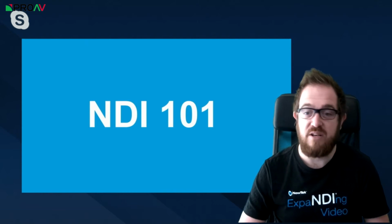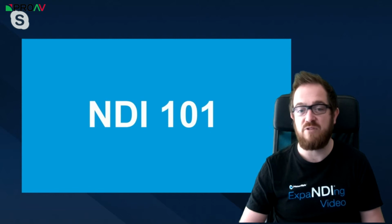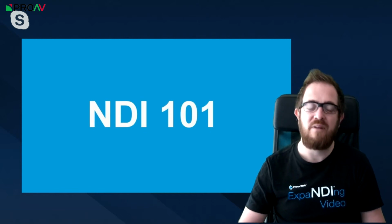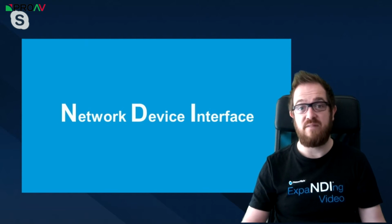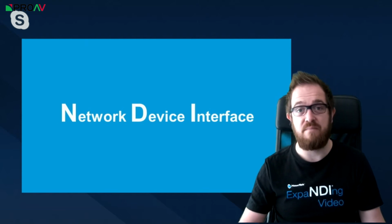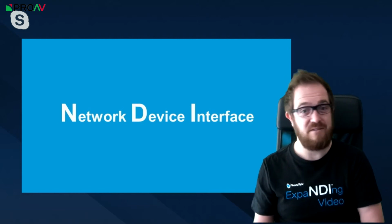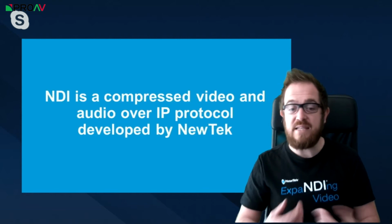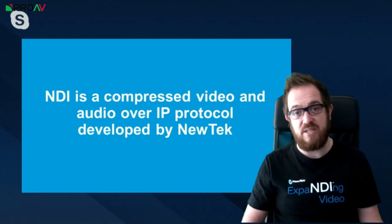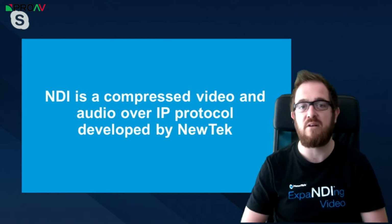If we just have a quick look at some of the basic concepts within NDI itself and what we set out to achieve, we'll just do a very quick NDI 101. NDI stands for Network Device Interface. It kind of does what it says on the tin. A bit like SDI, Serial Digital Interface, we're basically putting devices onto a network and ensuring they can interoperate with one another. It is a compressed protocol. It compresses video. The audio is linear PCM audio, and we'll cover more detail on that shortly.